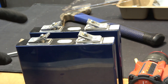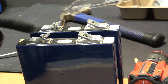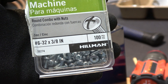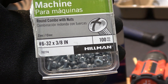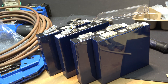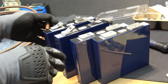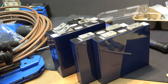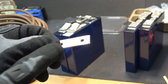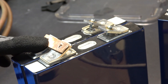That's awesome. The first one took me a long time to figure out, but once I figured it out this second one took me five minutes. In case you're wondering, the screw size is 6-32 and it's three-eighths of an inch long. I'm planning to make a 12 volt battery out of these cells. Here are the other two cells and I need to connect them together in series. I'm going to use copper pipe to connect them — I cut the pipe, flatten it out, and drill two holes. It's a size three-eighths copper pipe. Now I just need to put it on and put on my screw.